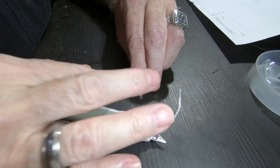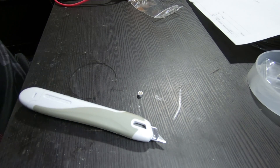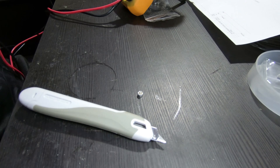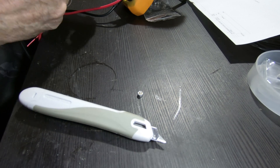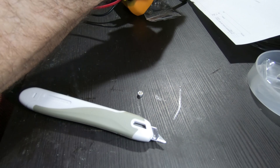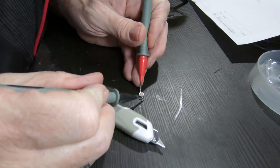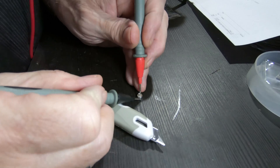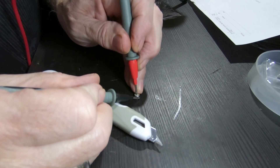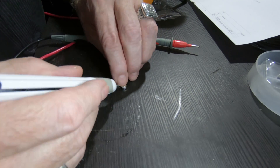Let's get the meter and double check. Sure looks like hell — I don't know if I did a good job or not. Let's see. Let's turn this thing on and put it on beep. I've got this silly thing — I had the wrong switch pushed. Alright, so we're going to hold the case. I'm going to test either side of the case. Now we have a connection, so I'll hold the center pin — this pin that used to be connected to the case — and it's still connected. Always test it. Be sure you test, especially if you're old and blind like me.